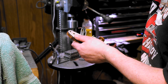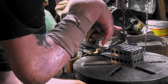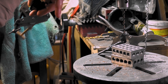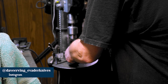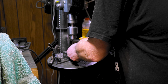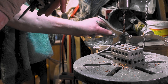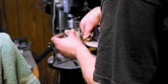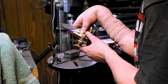On this wood it's thicker. If you've seen my videos before, I always drill one side, then open the clamp and put the other side, and drill through both. I need to use one-two-three blocks — I got these on Amazon. I always use something to stop, just in case this gets out of my hand so it's gonna stop there and not come back and hit my hand. I got my quarter-inch screws since these are quarter-inch holes — if you use eighth-inch holes, do eighth-inch screws.